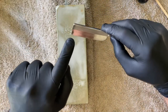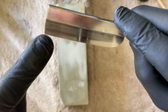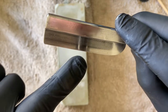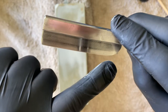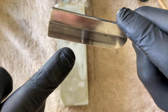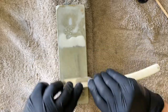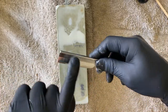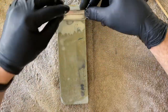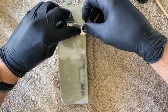I've already inspected the edge under the microscope. This bit has got a small little chip in it, but the bevel is essentially set. Working towards the heel, the bevel is less set, but in that area there are no chips. I'm going to start by establishing the bevel more properly here, then slowly blend over onto that area and work on the chip area. There's already quite a lot of swirl forming from the softer iron on the frame, and I've got a lot of bias towards the edge to minimize wear on the spine and focus cutting power on the edge.